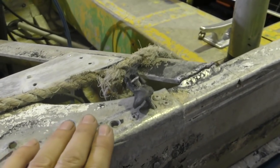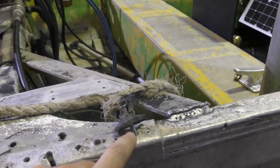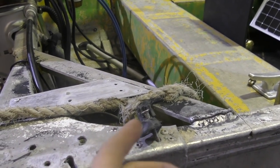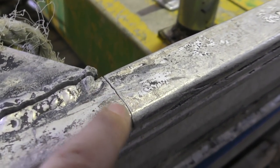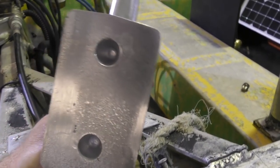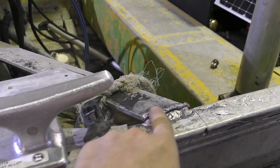But as most of you know this boat cops a pretty hard life. It sits during a storm whacking against a pontoon, mostly because the green machine has very little freeboard, and they get smashed. Sometimes the plastic smashes on the cleat, sometimes the stainless bolts actually snap because they're relatively brittle being stainless. Then you end up with things like this — a big crack through here as well, the whole thing needed welding up. My plan was to get some weld-on cleats rather than bolt-on cleats that don't have holes in the top, and weld them onto the deck possibly over some of these cracks.